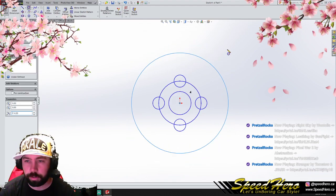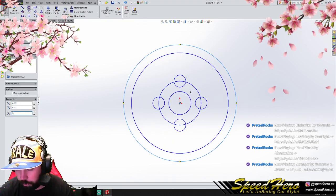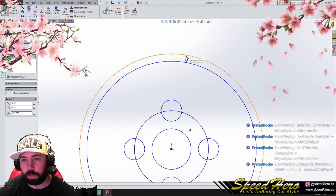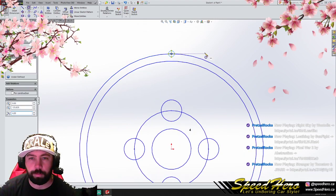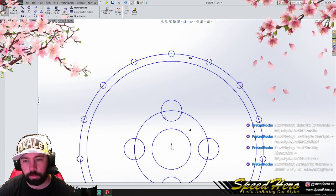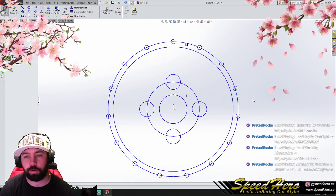Okay. Now we do have a 9-inch face ID. This is the biggest that the face ID can get. And then we're gonna have a 9.75 by 2, but this will be inches, bolt circle, and we're gonna use M8 bolts. So this should be 4 millimeters. I'm gonna use 15 of these. So let's spin this around at 15. There we go. Cool, so we have a rough, this is essentially just a two-dimensional drawing of all the holes we have to drill in this thing.